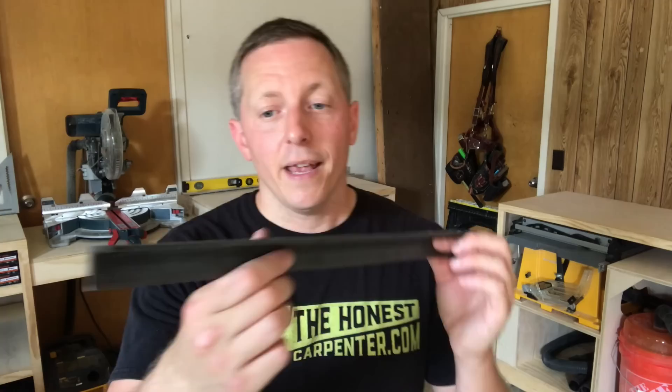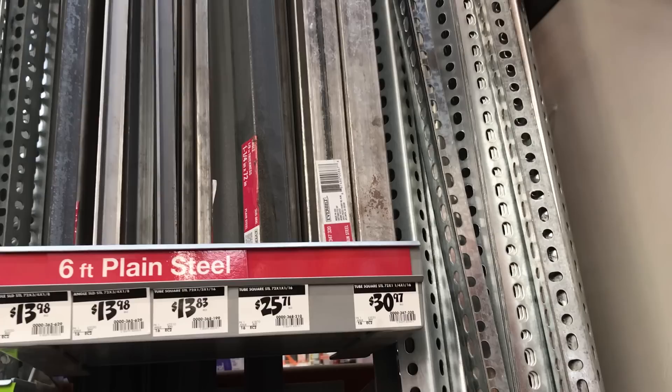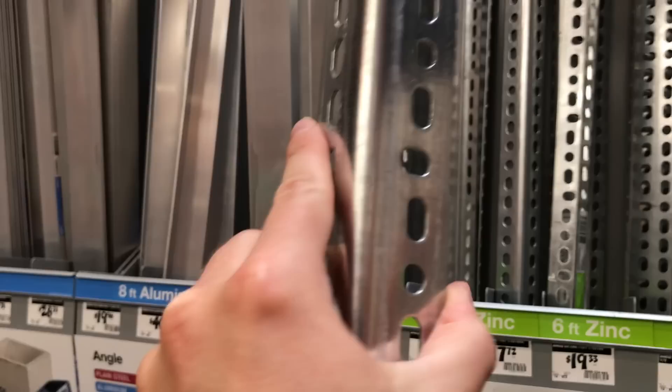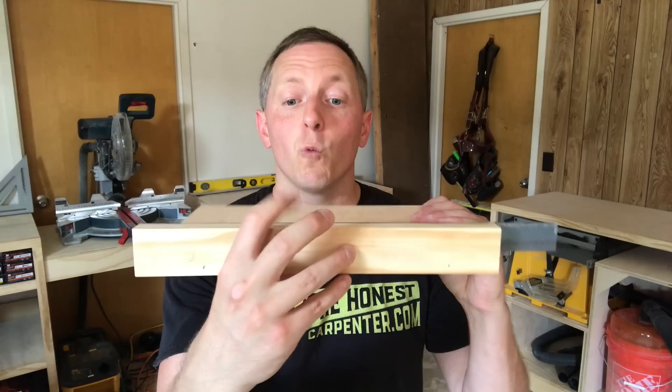Metal just has incredible strength properties. It can be very thin and narrow, but still be very strong. You can actually find a good number of metal building materials in the big box stores — Lowe's and Home Depot both carry engineered metal products, usually near the hardware aisle. There you'll find a variety of 4- to 8-foot lengths of steel and aluminum in different configurations. These right-angle products are my favorite; the 90-degree inside corner creates a lot of strength and you have two flat faces for support. In the past I've used slotted zinc-plated steel, but for this project I wanted something even narrower, so I went with plain angled steel in a 6-foot length — just 1 inch across both faces. With half-inch ply for the top and a half-inch face frame, the full width of the steel would be hidden behind the face.